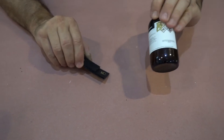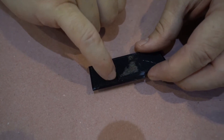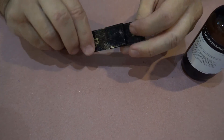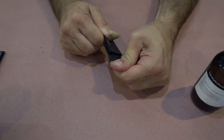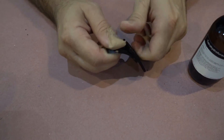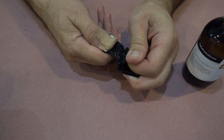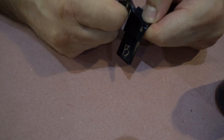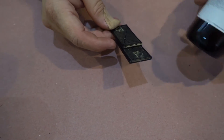Let's move to THF, one of the organic solvents. There is no staining — there's a little bit of shininess, which I think is just because it's a solvent eating the surface. You could probably use that to make the whole thing shiny by smoothing a little on with a buffing cloth. In shear, the grip is amazing. In peel, this has been welded together — it basically fused the two rubber pieces. Remember, this is not a glue; it's a solvent that melts the TPU on one side and the TPU on the other and forms them together. I can't rip this apart at full force. In summary, the THF is a wonderful solvent and a great choice.